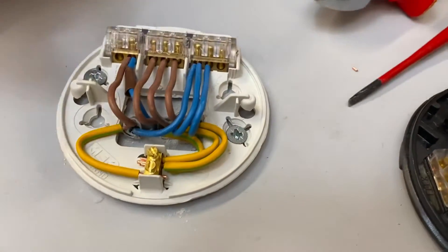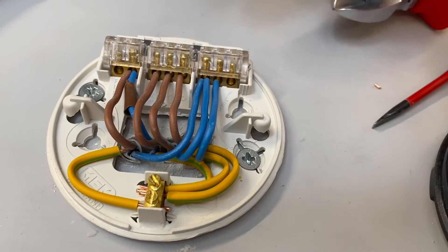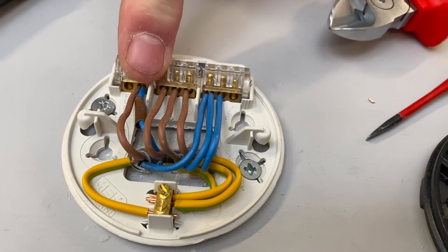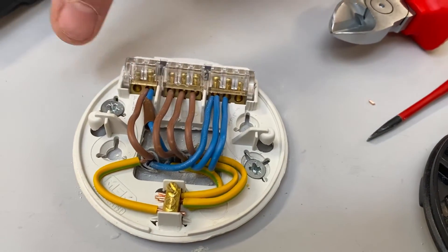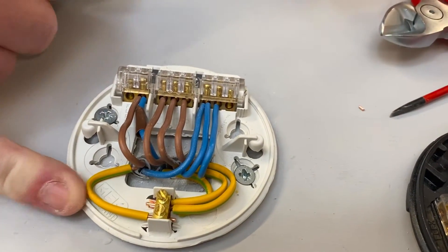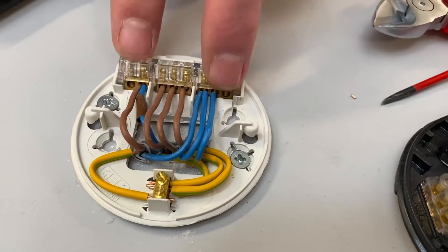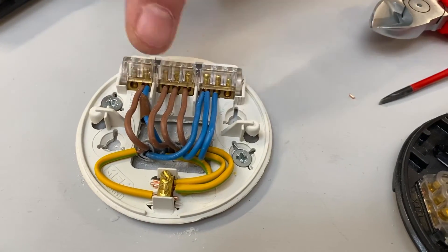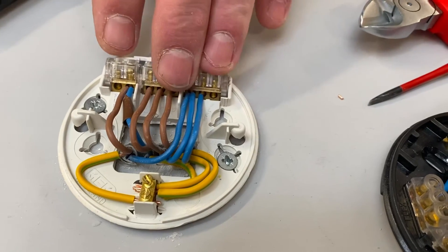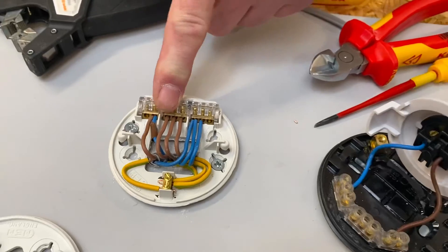There we go - we've dressed it and it still looks reasonably neat even though we've got an extra cable in it. We've got a neutral going off to the light in the same area, a switching line going off into the same area, so when this one comes on it also brings on the other light. We've also inserted our circuit protective conductor. In the next video in this series I'm going to show you how you can add a slightly different cable to do the same thing but also carry on the three-plate method. I hope this video has been some help.